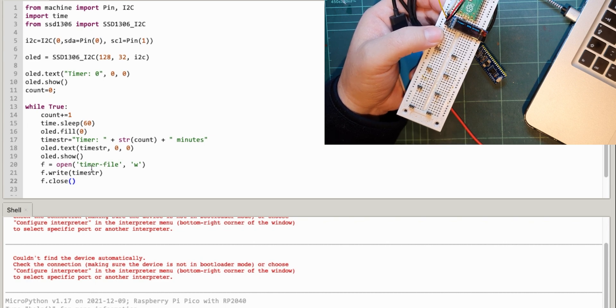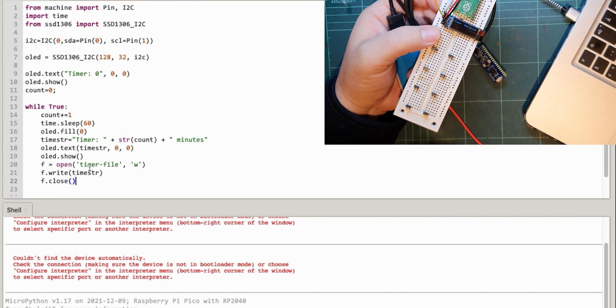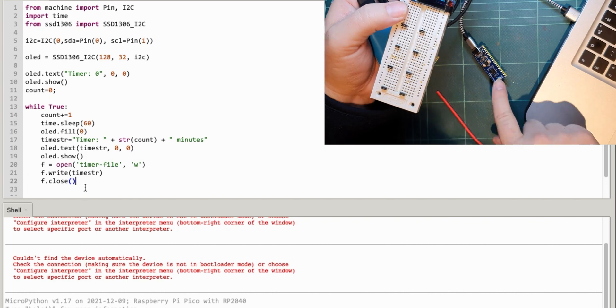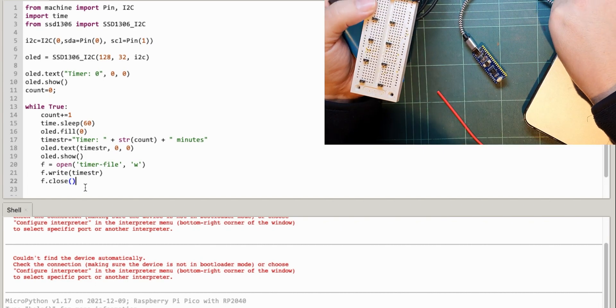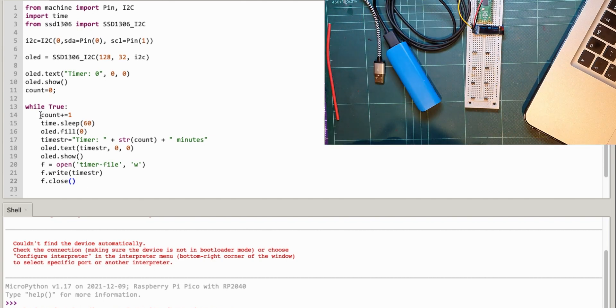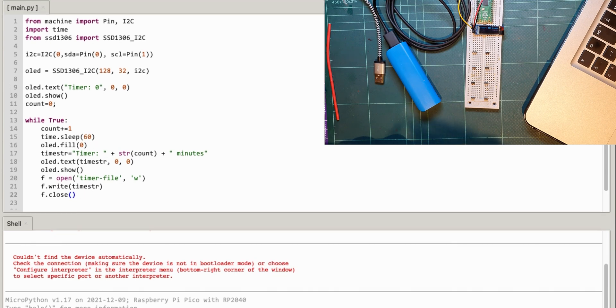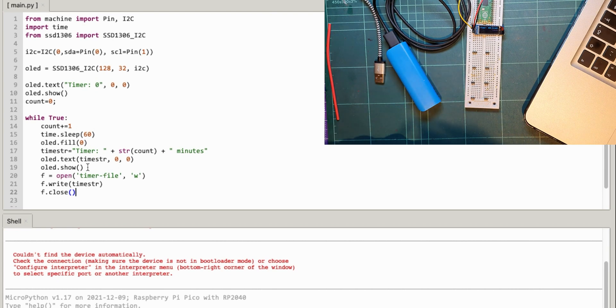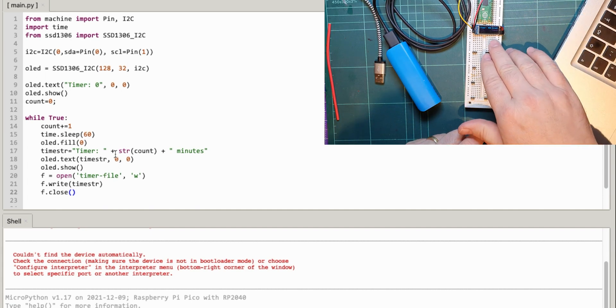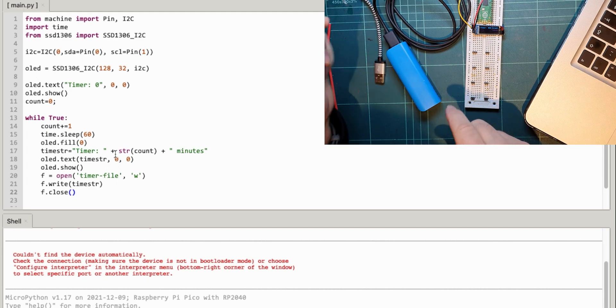This bit I don't think I've done on the channel before - it opens a file on the flash drive for writing, erases the file that's already there, writes the time string to it, and then closes it. So I'm going to unplug this RP2040 Plus for a minute and put the original Pico in. I have to be quick because it goes to sleep for 60 seconds, then writes the file. This starts when it powers up and the idea is once the power runs out, it will have the last elapsed time written to the internal flash.